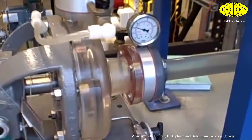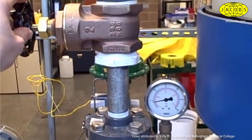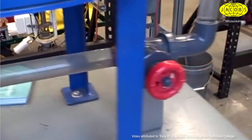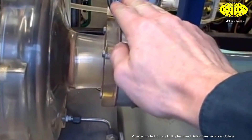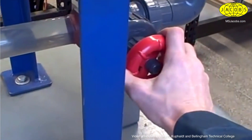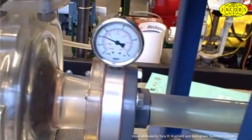What I'm going to demonstrate here is cavitation. We are going to purposely cause cavitation to occur in the system. We're going to do so by keeping the discharge valve wide open and pinching off the suction valve. That will reduce the pressure in this line, and you'll see this compound gauge show a stronger and stronger vacuum as we begin to pinch off the valve. I'll start to turn this clockwise and you'll see the gauge's indication go down.